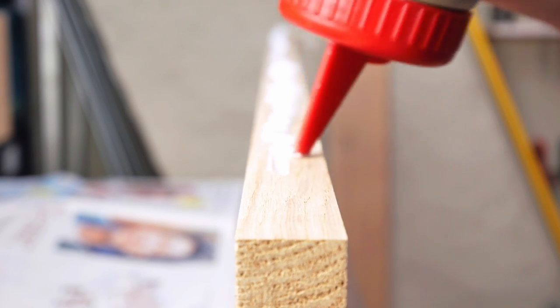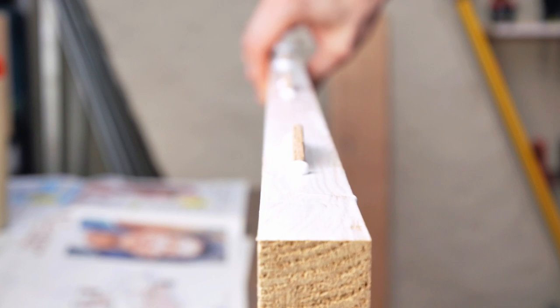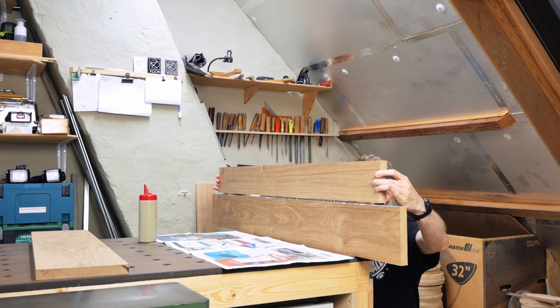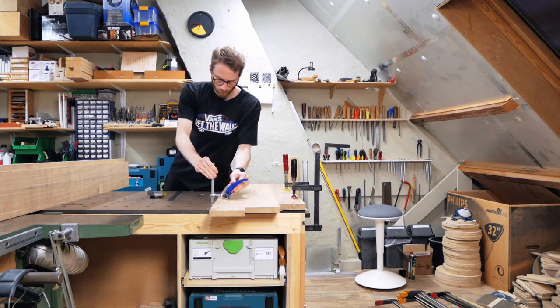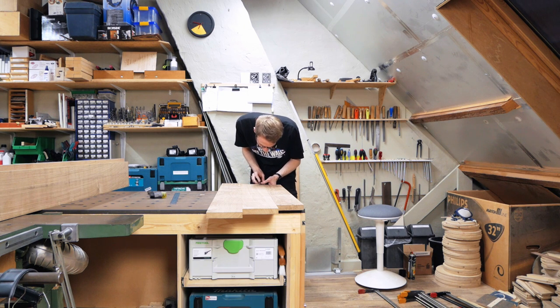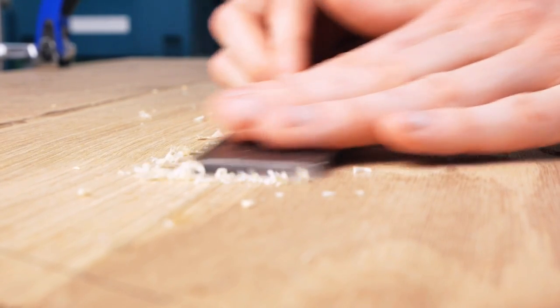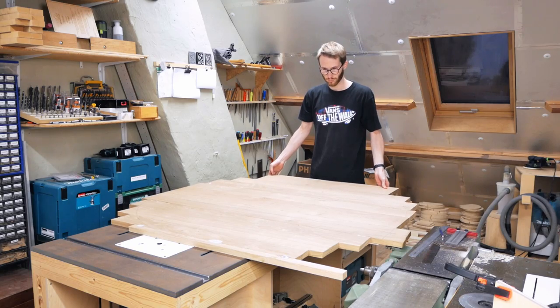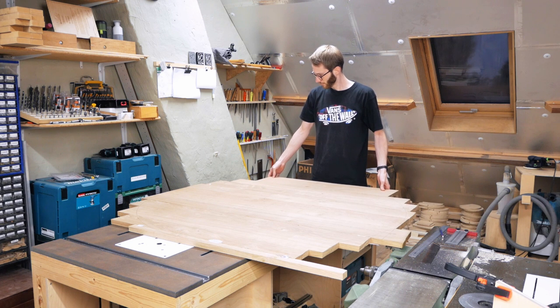It's time to glue the boards together and I did the gluing in 3 stages. The main reason was filming — I've never made a table by myself and combining a delicate glue-up like this while filming isn't easy. I do think using parallel clamps would make it easier but I'm still looking for a sponsor. Another way to support the channel is just subscribe! When all the boards were glued together, I noticed there's some weakness in the direction perpendicular to the boards. Luckily, this will be fixed later on when adding C-channels to the bottom.